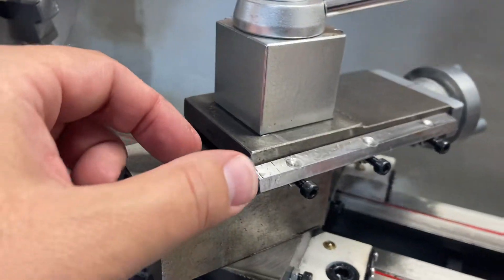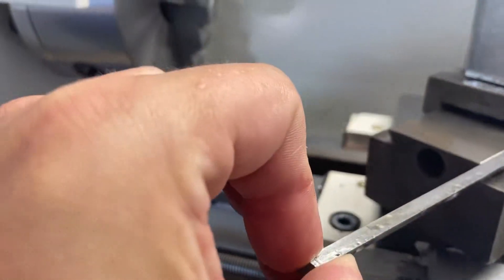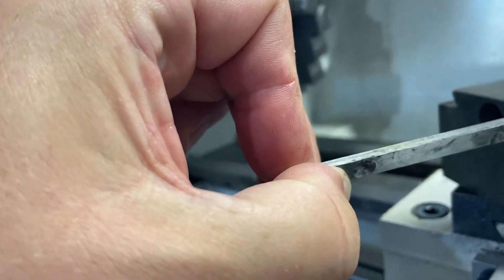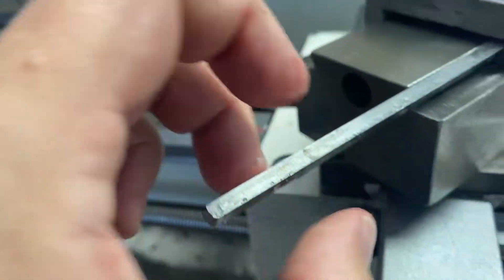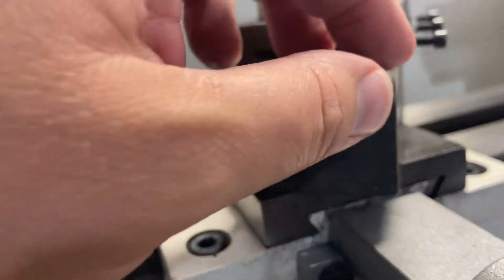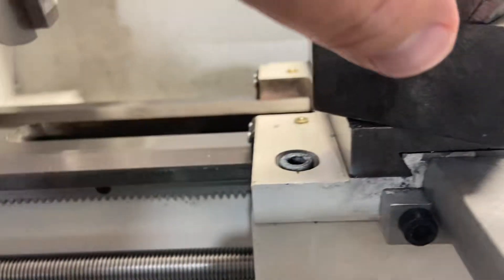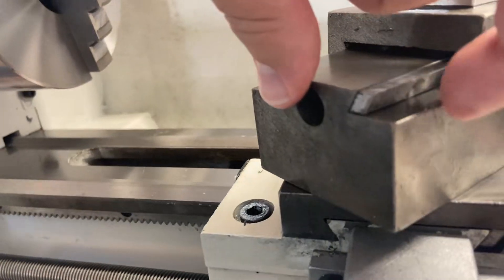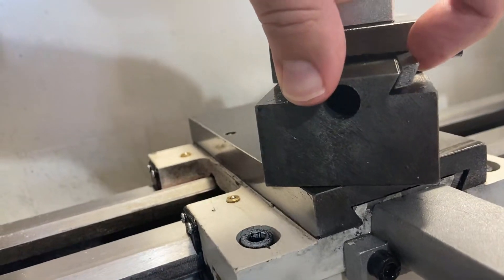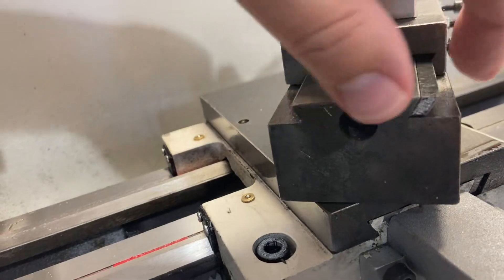It pushes this up and onto — it causes it to, with the dimples being low, instead of seating properly, if they were higher they would seat properly and push this down into the dovetail and it would then seat like it's supposed to. See, that's how it's supposed to ride. But instead it kicks low on the dimple, shoves it up and it ends up riding on the top edge. So over time, I think that's going to wear out the top edge of the dovetail.